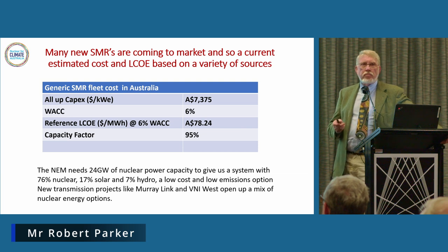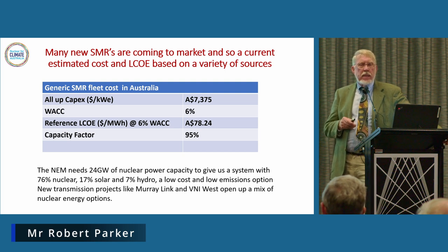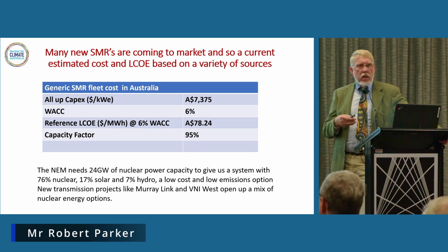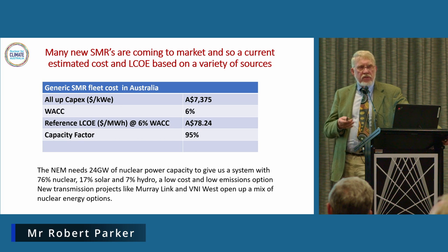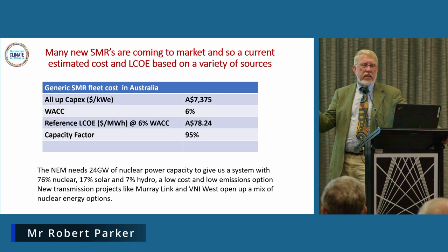On this slide, in the modelling that Robert Barr just showed you, we've settled on a cost that we're tending to use for our modelling in comparison to renewable schemes, in arriving at an optimum mix for Australia. Robert's model is quite wonderful in that you can put in amounts for transmission, emissions intensities, and different costs. The model also adjusts for capacity factors that are internally determined to increase or reduce the cost. When people talk about LCOE, it's intimately matched to the capacity factor — if you drop the capacity factor, your LCOE goes up.